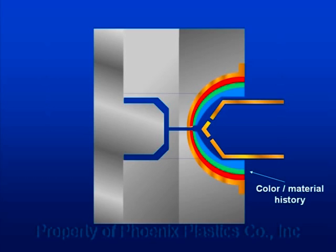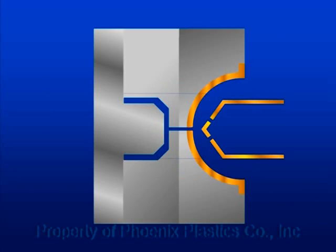To prevent this accumulation, the caps on the tips of the hot runner system have to be removed manually before purging the machine.